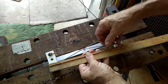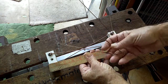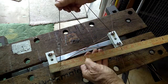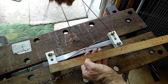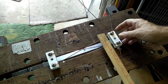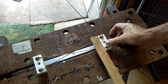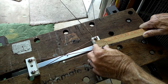The bows from this corner is 9.5 to the tip. So it's 19, start out 19 inches, bend in the middle, you've got a nice bow tie. The spread, 5.5 inches. And this is very easy. The insulators are 1.5 inches wide by 1 inch. This is 1 inch.